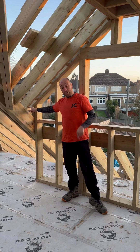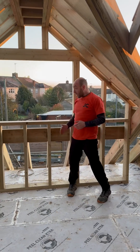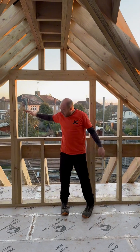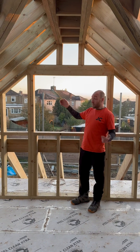Checking the floor's level — it's now the same on the other side — and then we've got a pair of rafters up. But it's the position on this wall that we need to find out exactly where to go. Even though I've got these two cheeks here and I left them long, I worked out how it's going to work with a minimum and maximum height using my gauge rod detail.